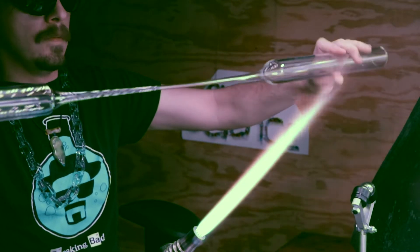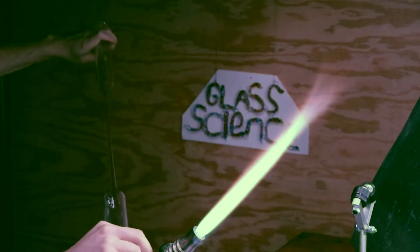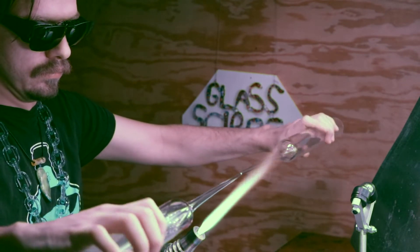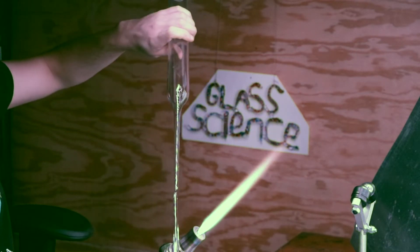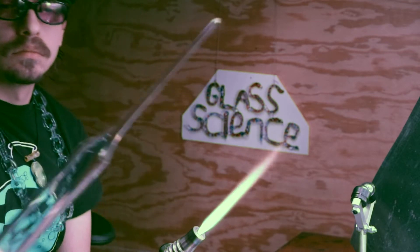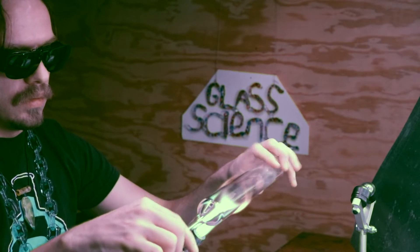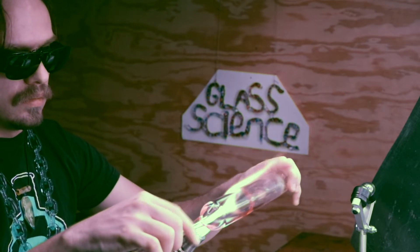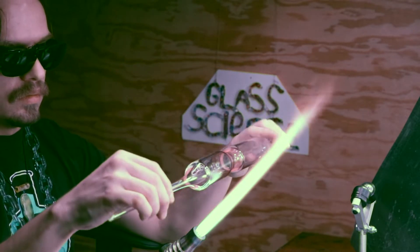This is one of the techniques they say you should really practice a lot when you get started. And honestly, I haven't really done it at all, and it turned out pretty well here. I think that's just because I do a lot of other stuff that incorporates the same principles, and I've watched a lot of other glassblowers do it. Working on this larger and thicker tubing, I found it's much more difficult to attach the blow tube in the scientific method, and it seems much easier just to pull a point for these large tubes.